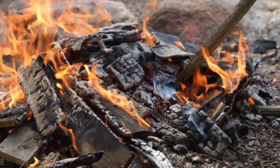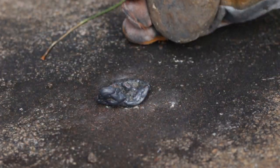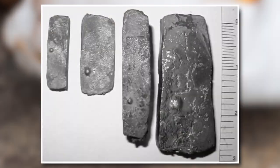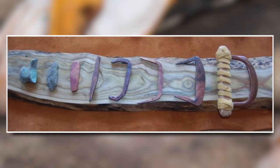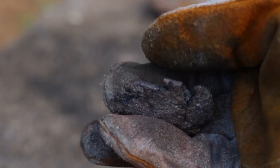The actual pounding is quite difficult and repetitive. Though the natives likely did not have welding gloves or long metal pliers, simple wooden tongs could have been used to handle the copper. With this nugget, I am just trying to flatten it, though this may not necessarily be accurate. Most nuggets would have been turned into square copper bars — essentially blanks which could be turned into a variety of tools. My nugget had some problems in its structure and some small pieces came off as I tried to flatten it more.